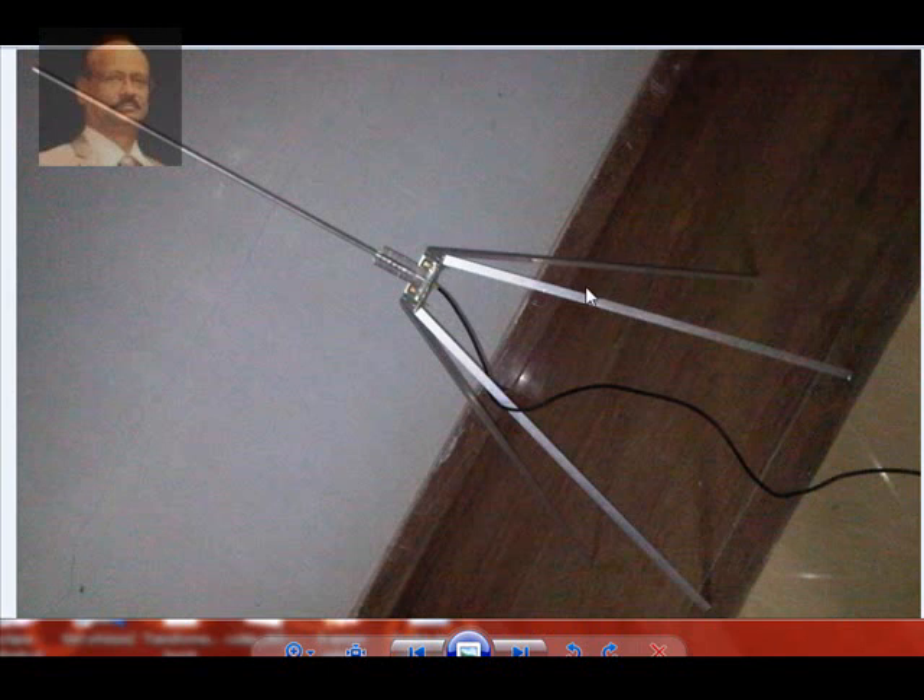The GP (ground plane) antenna is fabricated using angle aluminium — not iron, always aluminium. We have a plate, some arrangement of fittings, a rod-type aluminium element, and a coaxial cable connected to the device as seen earlier. That is how the whole system is complete. As mentioned before, this is a very high-frequency device.